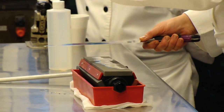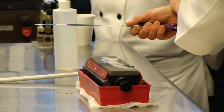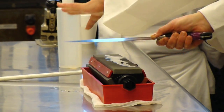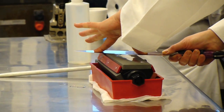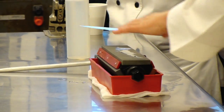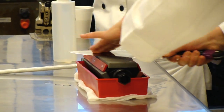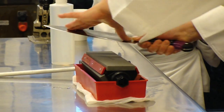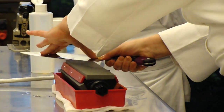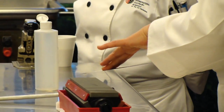I'm going to use this hand, put it on the blade and push down. On the hand that's holding it — I'm doing this right-handed — the thumb is on top. I'm applying pressure down onto the stone. I'm going to start from the heel and go to the tip, corner to corner. I'm going to go several times. My knees are a little loose, kind of like I'm getting ready to serve a tennis ball. Whatever I do on one side, I'm going to do on the other — about five or six times.